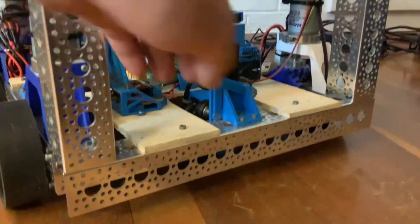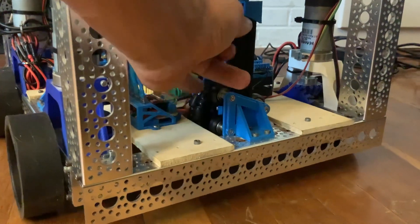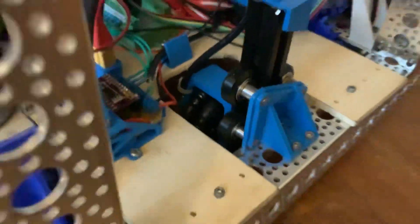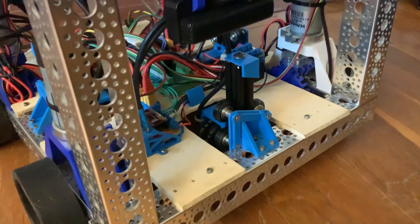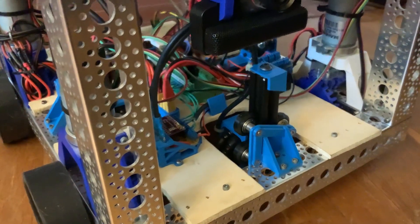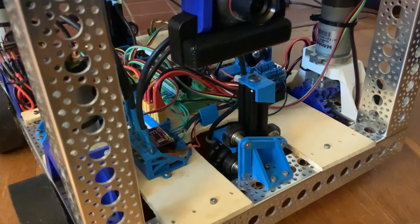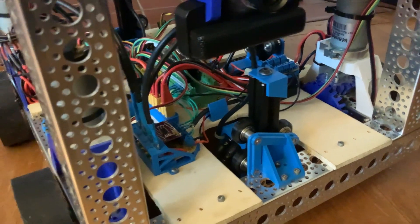One of the new things on this version that I really like is I have these odom wheels — or odometry wheels. You can see they have omni wheels on them and I have an encoder on it. They can go up and down, it measures the rotation, and so I can mathematically figure out where the robot is in the room just based off that. Then I use some other sensor data and programs to try to get a better guess of location.